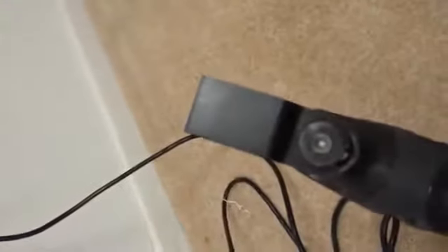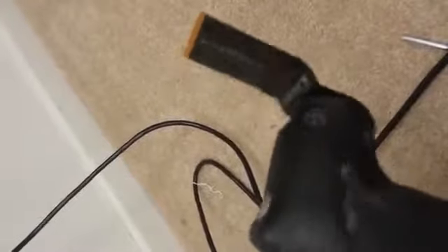It's called oscillating — that's why it's moving around. To remove it, you just take that wing nut arm, use this little hex wrench, take the strap nut off the end, and it comes off easily. Then the Craftsman apparatus comes off and the EZARC goes right on.